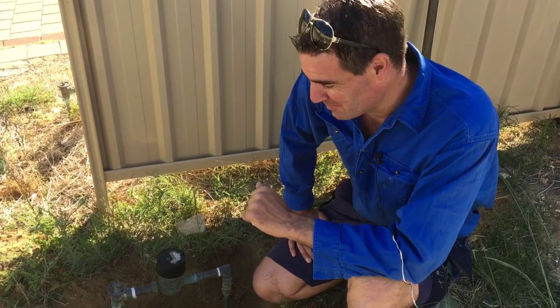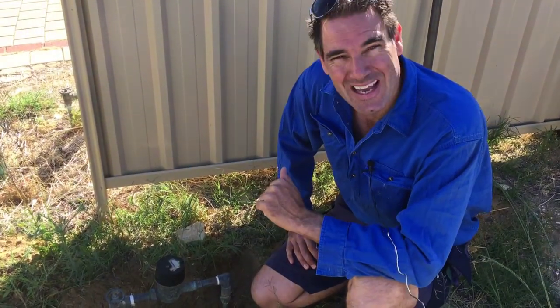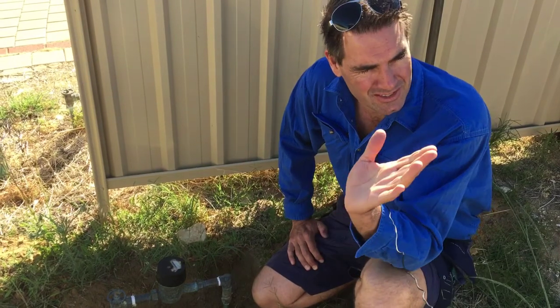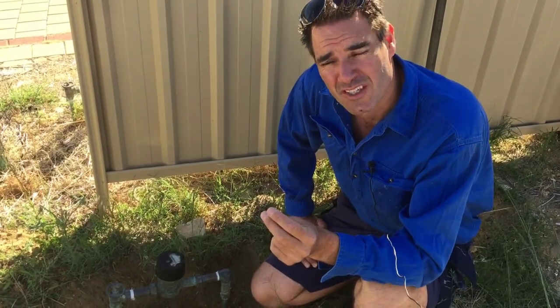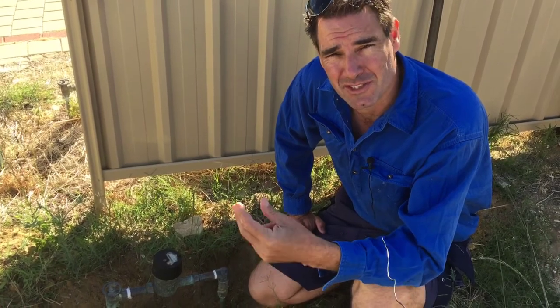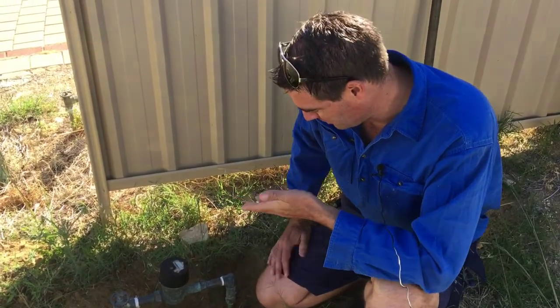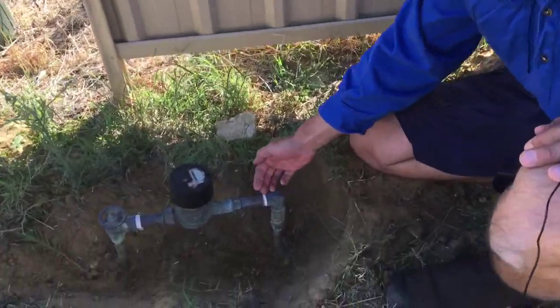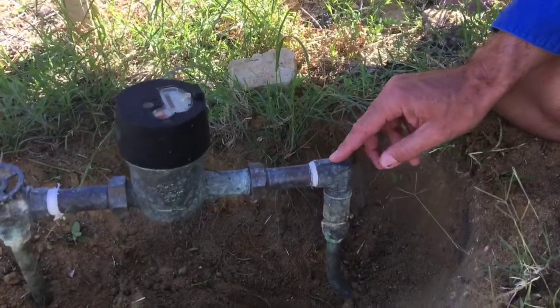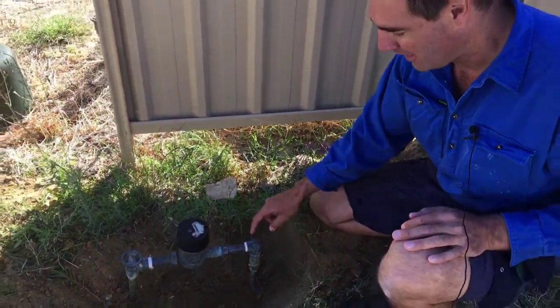G'day guys, how are you going down at the bottom of the hill there near the VP, Baza Garden Street. I've been out here at quite a few houses. I've got a call from a client here saying that the hot water system valve just keeps leaking all the time and she's had it replaced nearly two times already. You can see on her meter here there's a pressure limiting valve - that's what they look like - so it's a massive bit of brass. Now these ones are the AVG and these have been failing.